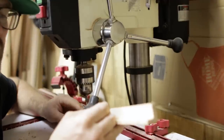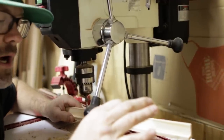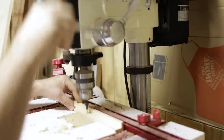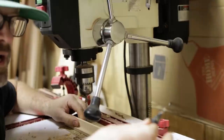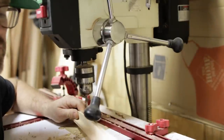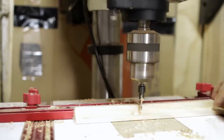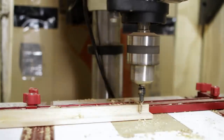Each of these brackets will get attached to the side with four screws — no glue, in case I want to adjust them later for different containers or even if one breaks off. I would normally do this with my handheld drill but since this is really thin material I don't want to plunge too deep, so I'm going to do it on my drill press where I can set a stop, a limit on how deep I go.